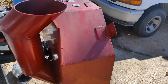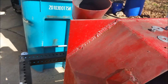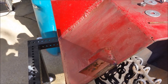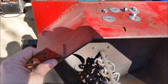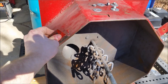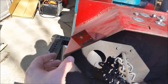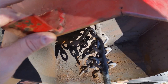Now I should have made a video of this when I was building it, but this is my first real welding job. I've welded before in the past, but not where the strength was actually critical. I guess that's no excuse, I should have done it anyway, but here we are. The brackets that hold on the front door are just quarter-inch angle brackets — I got a big long piece of angle iron and just cut sections off of it.